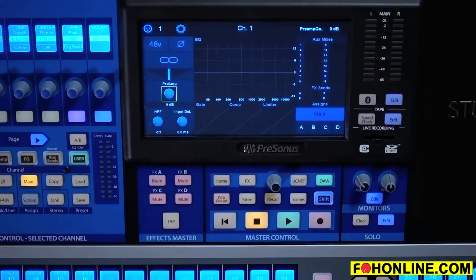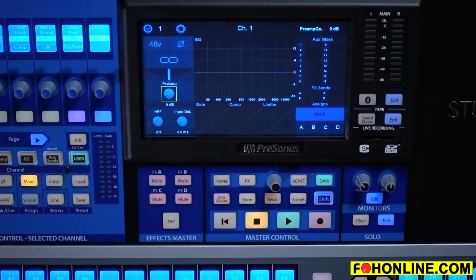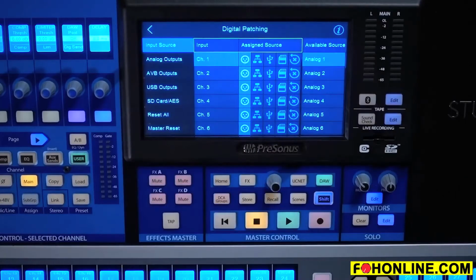So let's start on the console. There's a couple of different ways that you can access the soft patching or the digital patching. You'll notice that our overview screen now for our channel has changed a little bit. We've changed the layout, but one important thing up here on the top left, we now have an indicator that shows which channel you are on and where that channel is sourced from. So if you touch that source button up there, it's going to open up your digital patching screen.